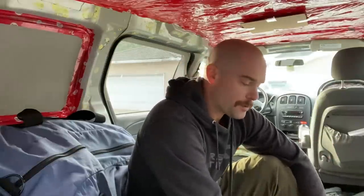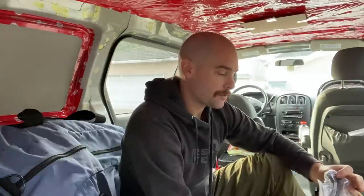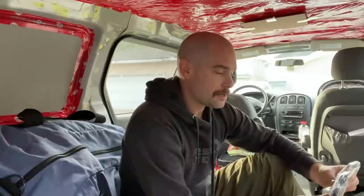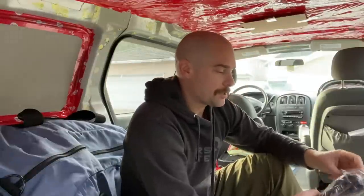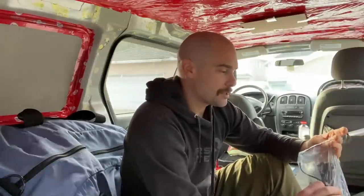Yeah, I had to do a little bit of homework. And instead of going with one battery, I actually had to buy two batteries because two batteries in parallel on 12 volts is going to give me a 50 amp. One battery alone, the batteries like to be charged at 25 amps. So if you go 50 amps on one battery, it'll really shorten the life of the battery. It can take it, but it's not good for it. So that being said, I bought two batteries so that they can take that 50 amp and they'll charge up pretty quickly with this thing.